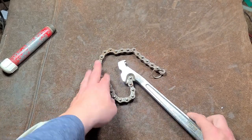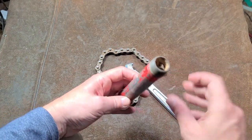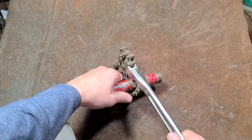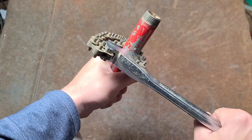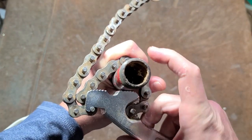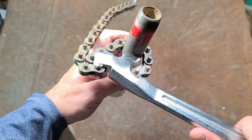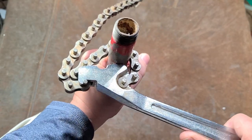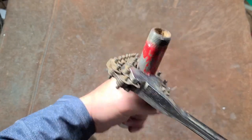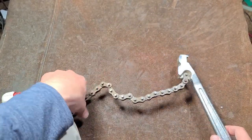and various other things besides normal pipes. We have some three-quarter inch pipe here — that's the inner diameter; the outside diameter is about one inch. If we get the chain on there, I just can't get any grip. I should be able to easily lock this up with my hand. The idea is as you push down on the handle it yanks the chain, drawing the pipe tighter into the handle — pressing hard with the teeth while the chain assists. It just doesn't work in either direction on smaller diameters, which has always been the disappointment.